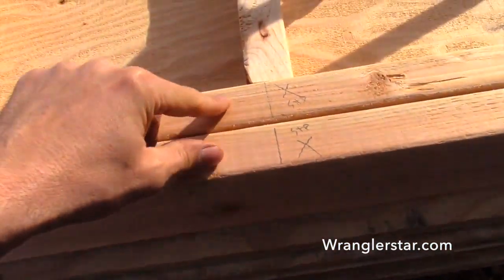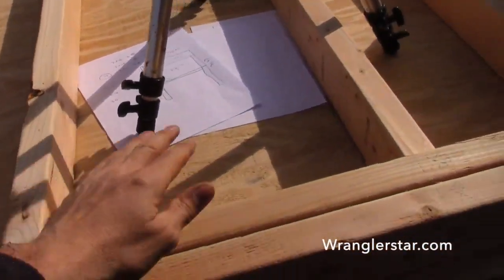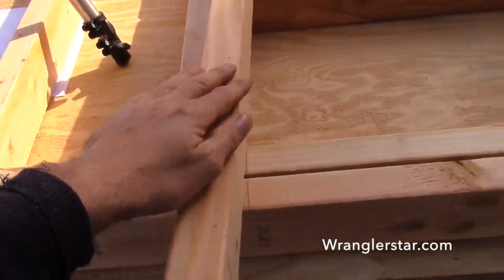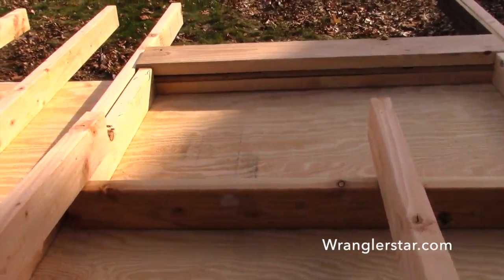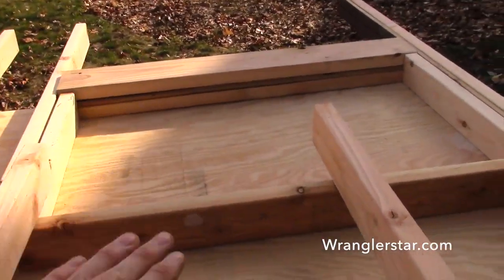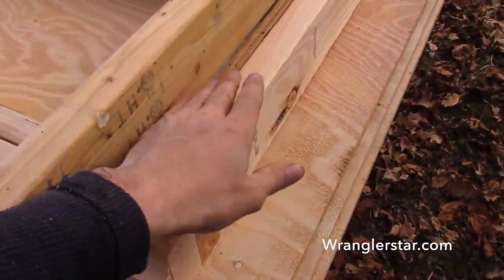This is the bottom plate, this is the top plate — meaning this is the very bottom, and this is the one that will sit on top of the studs. We've got a stud, stud, and right here we've got another stud. These are cripples — they're on the bottom and go underneath the window. We've got a big corner window here, 36 by 22. We've got our header in there with our plywood spacer, and our second corner over here with another plywood spacer.